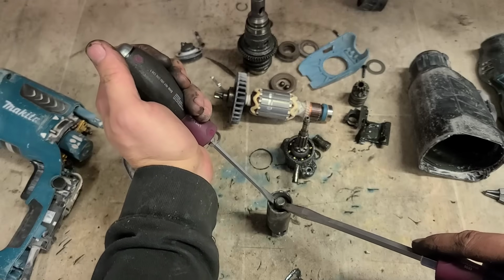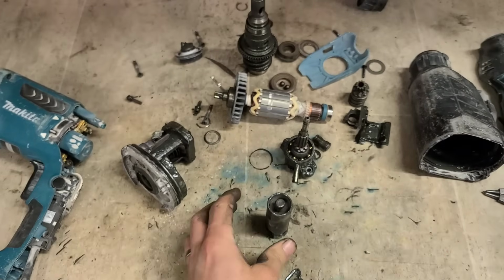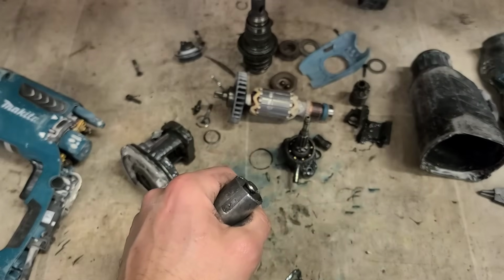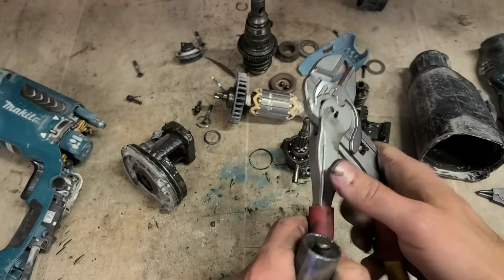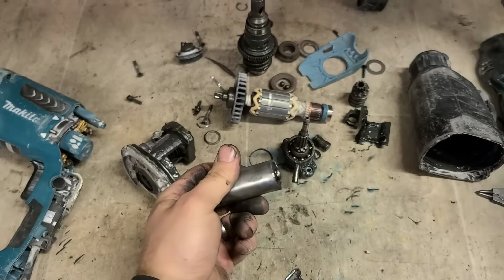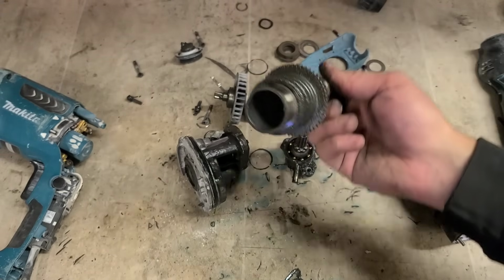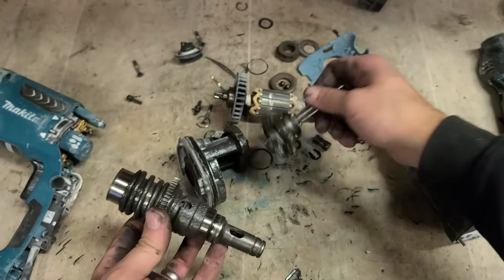That is tight. Probably not be able to salvage this. That's jammed. Replace the O-ring, the striker and the piston. Will also give us a good washout. Get rid of all the dirt, especially up on here. There's bits of aluminium and dirt mixed up inside that tool holder. Get all that off, get off all the old grease.